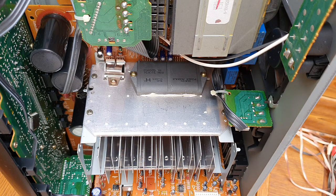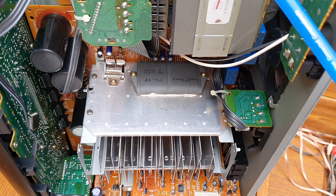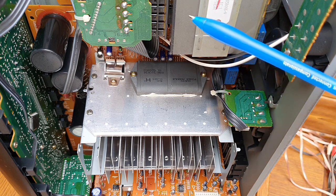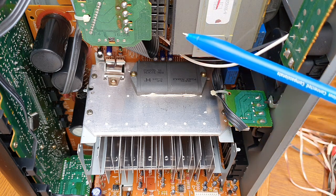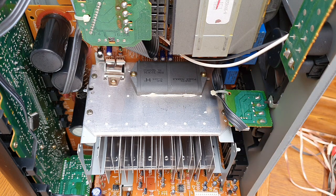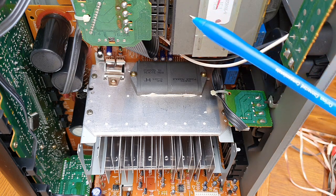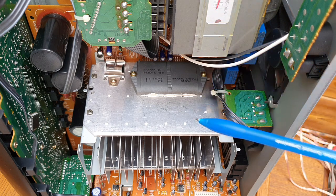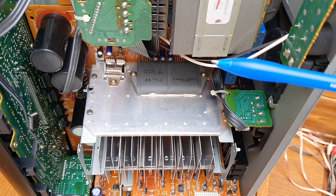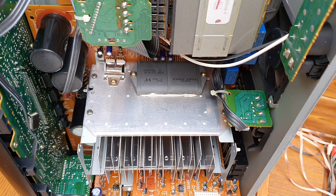One of my subscribers asked me if an amplifier is heavy due to a big power supply, is it a sign that it's a good amplifier? I say, well, yes and no. Yes, because a bigger power amplifier requires higher current, and you have to have a bigger power transformer. So usually they are heavy because they have to drive a lot of current to the PA stage. But at the same time, technology advanced. Now you have switching transformers which are half of this size but produce the same power current to push those amplifier stages. But the fluctuation is very high in the other module.